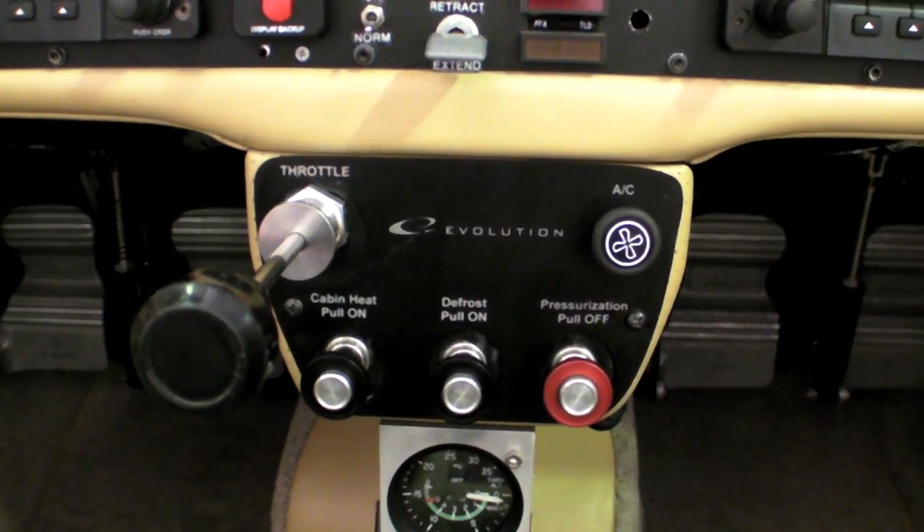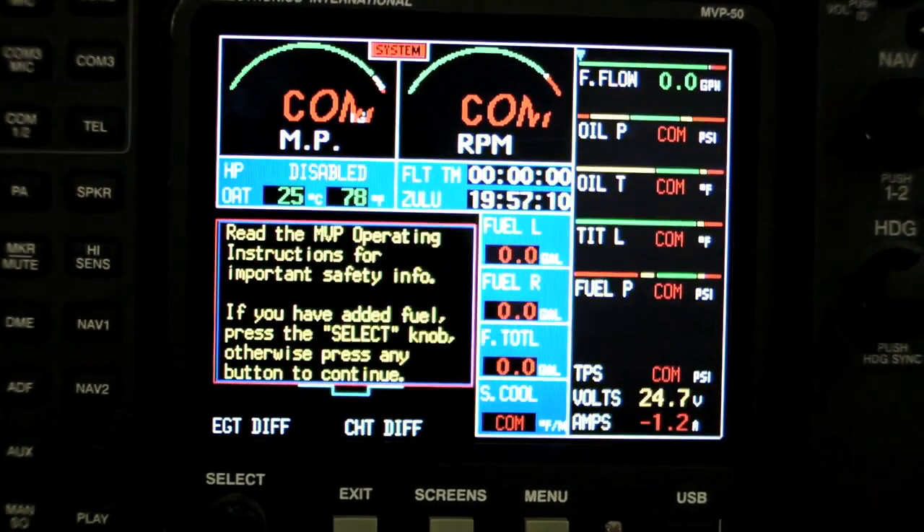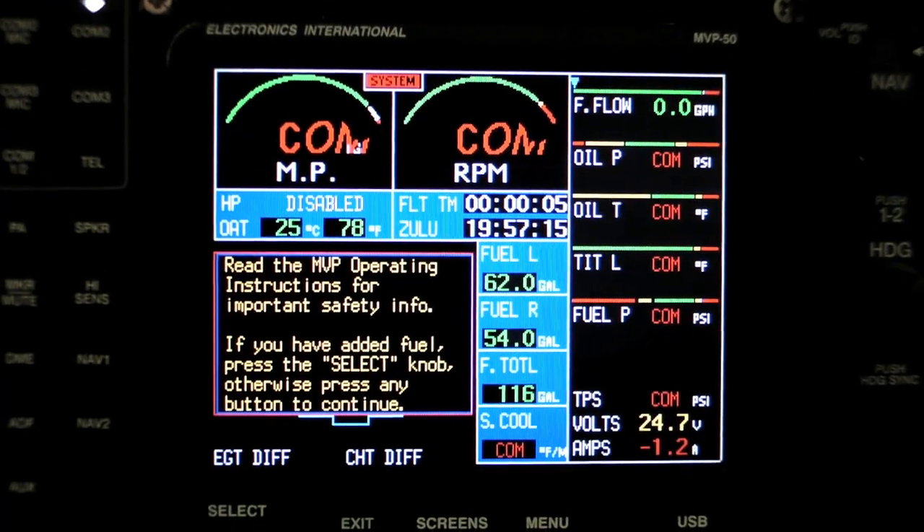Working with the airframe manufacturer, we'll work out a strategy where depending on the power requested by the pilot, we set the correct fuel setting. If you're pulling back on the throttle, we'll recognize that you probably want to go a little bit leaner, so we set the fuel flows on the lean side of the spectrum. If you're running higher powers, we're going to use a richer fuel mixture because we know you want power and we want to protect the engine and give you that 2,000-hour TBO. It is Lycoming's position that we are working with the FAA to get full Part 33 certification for this engine, identical to the one being used in the Lancair, and that will be available for use in any certified or non-certified application. We're working to achieve that certification by the end of this calendar year.